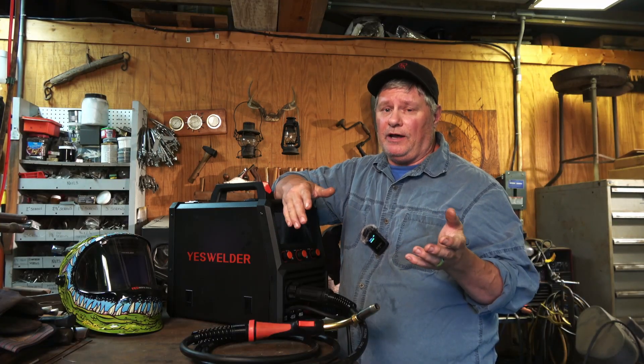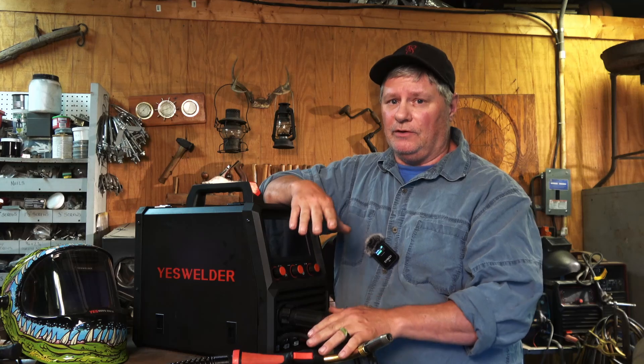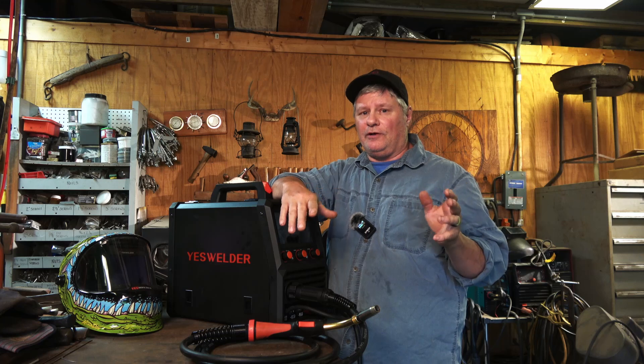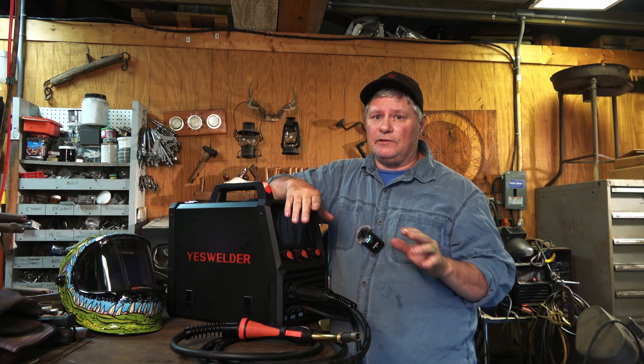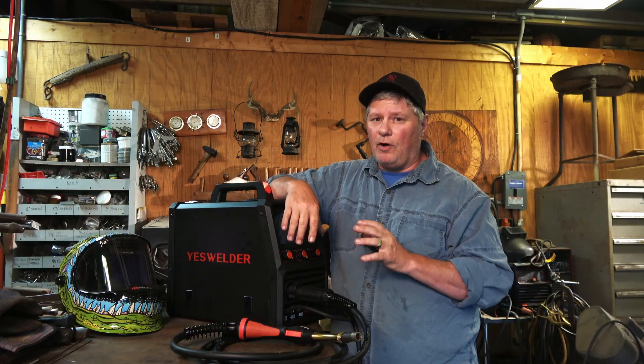All right, let's talk about some likes and dislikes. The ground clamp is a little on the light side, however it's heavier than the usual clamps on machines at a lower price. The ground cable and the torch could be longer, but fortunately for most of my work I'll be right here close to my fab table. The power cable is much longer than I've seen with these machines — it's like twice as long — so that's a huge plus. As for likes, I really like the intuitive screen — it's huge too. I wear glasses and I had no problem with the setup even without instructions. I like the torch with the swivel connection — it's very ergonomic and feels good in the hand.